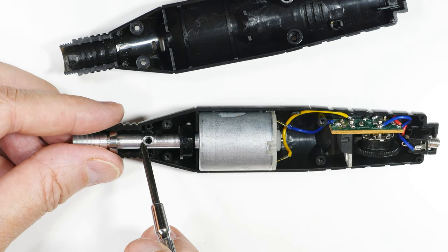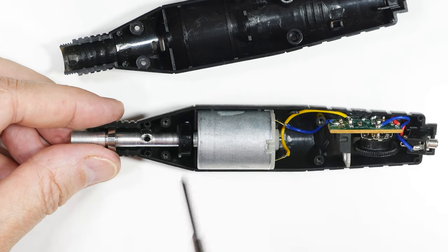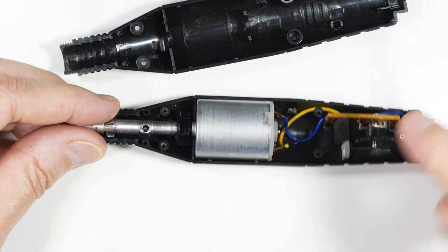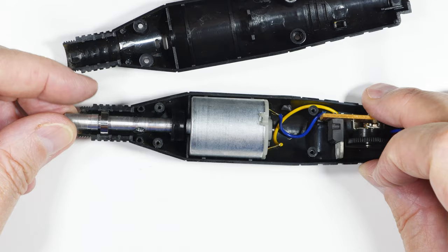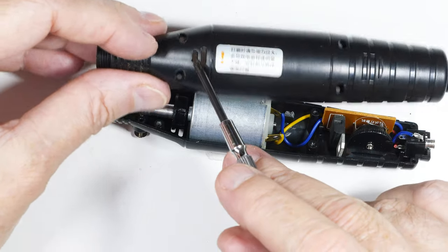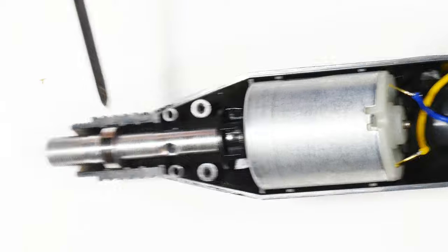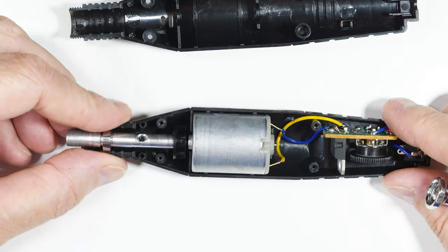This hole would need to be drilled right up here, or this has been pressed on too far, to keep the pin from fully engaging in the hole. Also, they have a little fan right there — that little black thing is a fan to stir the air, and there are vent holes on the other side. Here's something I almost missed: they actually have the shaft supported by a nice little ball bearing. So it's not robust like the Dremel, but it does have some thoughtful engineering.